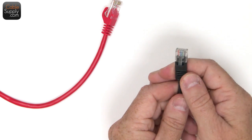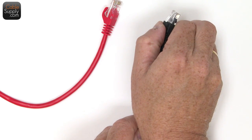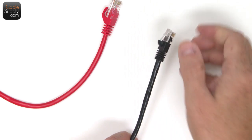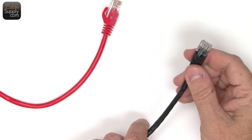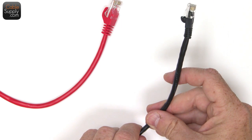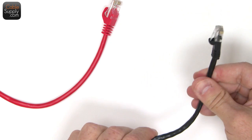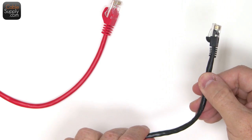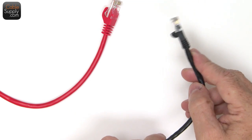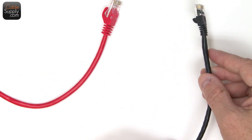It's pretty good. A lot of people use this. When you pull this out amongst many types of cords, the cords won't grab that little clip. They will just pass right over it, and then you're doing pretty good at that point. So these are pretty good. These are a good price. It's a nice purchase. It's reliable. You can use them for years and years and years. Also, in these patch cords, you have stranded cable, and stranded cable holds up better in bending all the time. If you're using solid cable, you can bend it off and on, but it's not as flexible and as easy to work with.